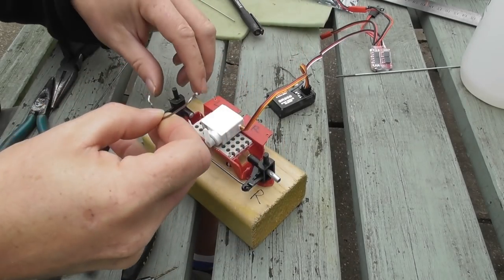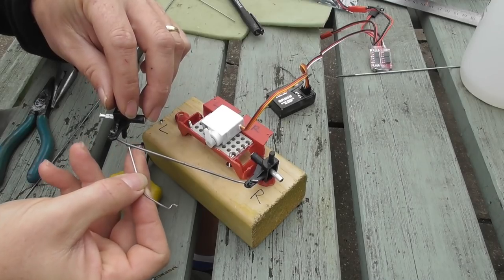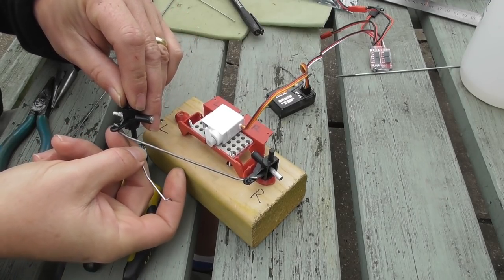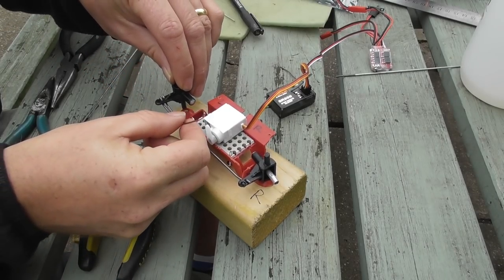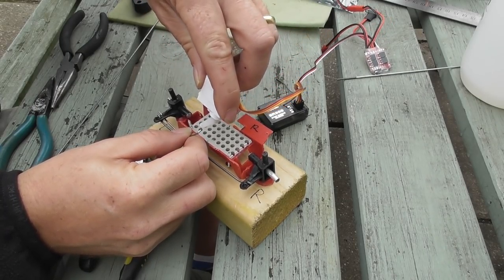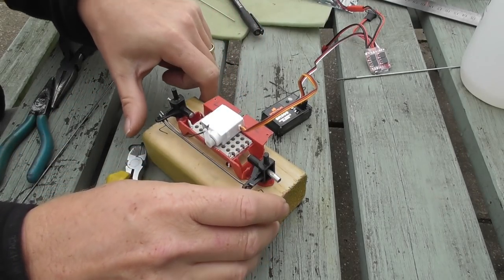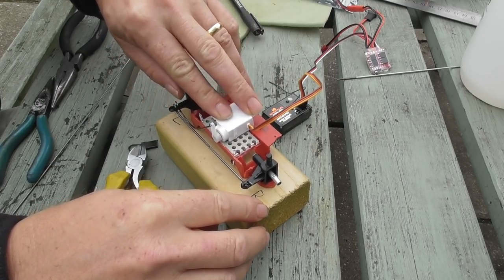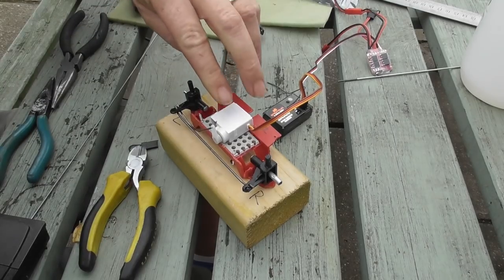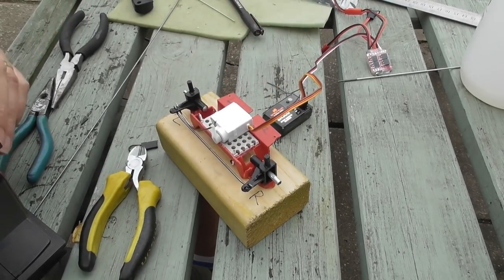I've cut out a little bit in the back here and that allows the servo to be mounted just there so that it's only protruding a small amount from the front. The other thing I did was drill another small hole in one of the arms behind the first arm. The reason I did that was so that I can have another control rod going from the servo arm to the steering arm there. This piece here resulted from all of that — it's just another piece of thin 1.5mm wire, made in exactly the same way and using pliers to bend it until I got it where I wanted it.